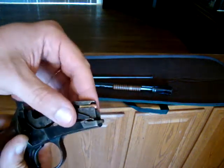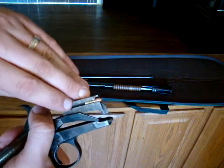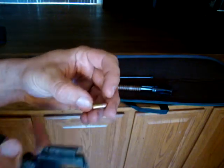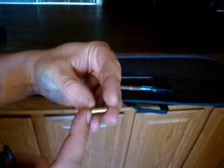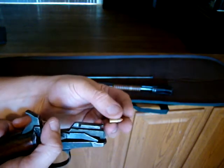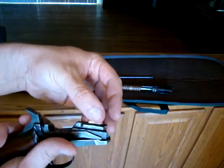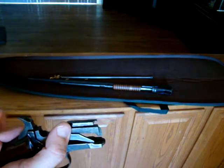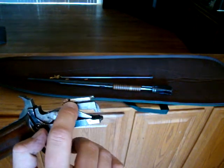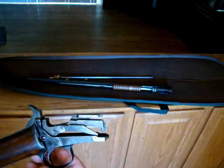When the action gets pumped, this elevator comes up. The extractor comes down this channel and pushes the round forward. Once it gets chambered, the extractor hooks onto the edge of that rim, since this is a rimfire case. When you pump it back out, the case — now empty after firing — is pulled back by the extractor. This kicks up and flings the round out of the way. The round sitting in the elevator assembly is then forced forward when we pump the action back to the forward position.